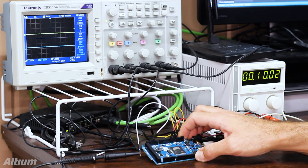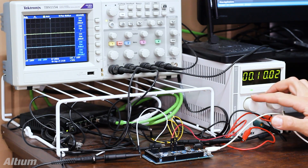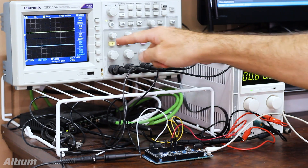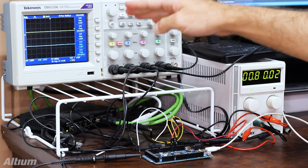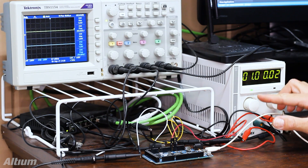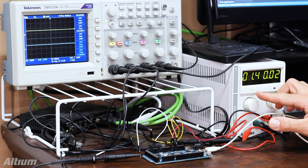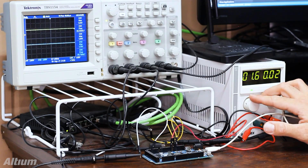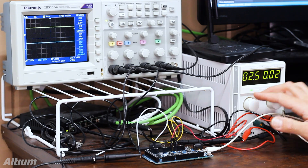So here I have an Arduino hooked up and I'm going to be running a manual test. This is just a basic DC test. You can see I'm going to vary the voltage — I'm going up, I've got almost one volt here. My top is the input, my bottom is the output. I'm just testing out my ADC and my DAC, and I have to validate. So I'm checking 1 volt, 1.5 volts, and I have to keep looking at the oscilloscope and verifying, looking at the max. You can see this gets pretty tedious after a while.